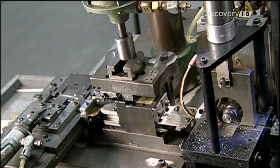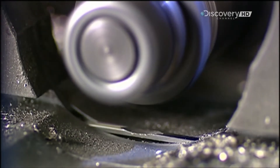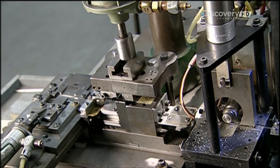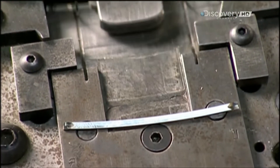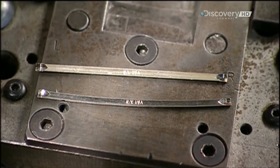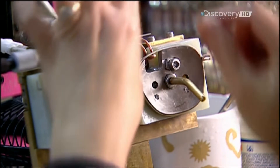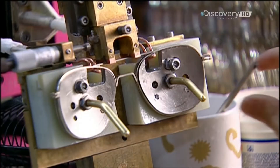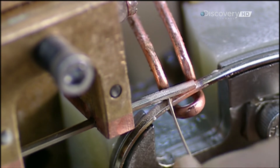Next comes the piece above the bridge, called the brow bar. An automated machine cuts metal wire to pieces the right length, then carves grooves on the ends, to enable the brow bar to fit snugly onto the top of the frames. Then it bends each piece to the right shape. The brow bar now goes into position. A little flux to remove any dust or dirt that might prevent the metal from fusing properly. Then, they braze the brow bar to the frame.